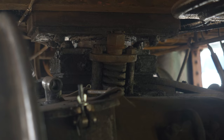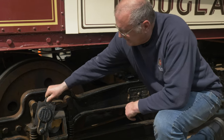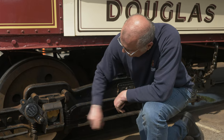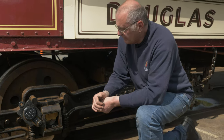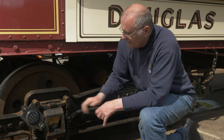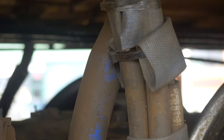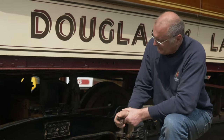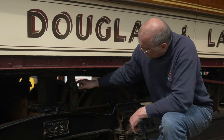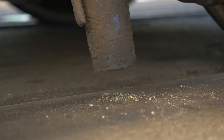To ensure a comfortable ride for passengers there are springs inside, and also on the axle box. If I open the axle box up, you can see the end of the axle — this is a brass bearing mounted on top of the axle, and inside there is wadding. Once a week we pour oil into the axle box, and the wadding lubricates the axle; without oil it would get very hot very quickly. Hidden behind the frame there's a pipe coming down from a hopper underneath the passenger saloon seats containing sand, so the driver operates a pedal to release sand by gravity down onto the railhead, giving the tram extra traction on gradients if required.